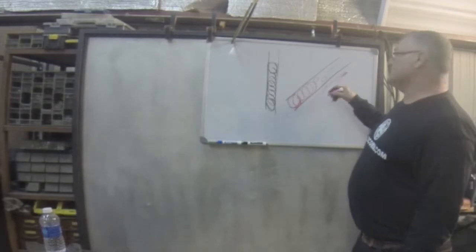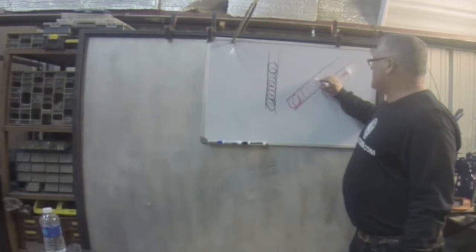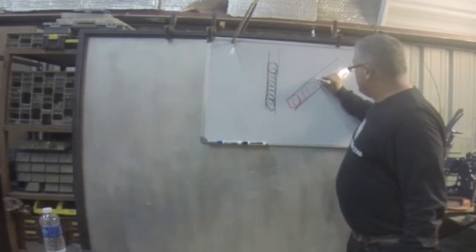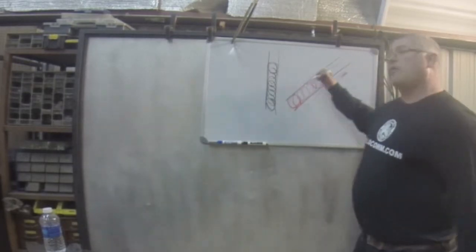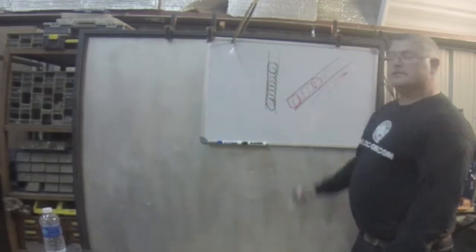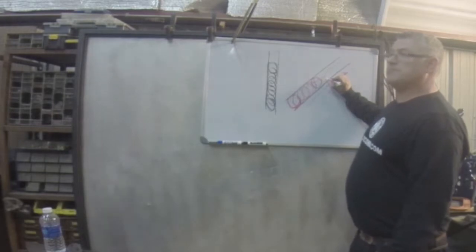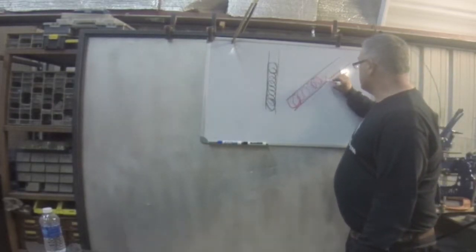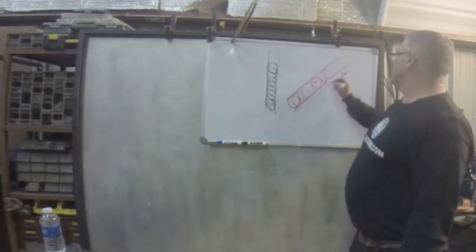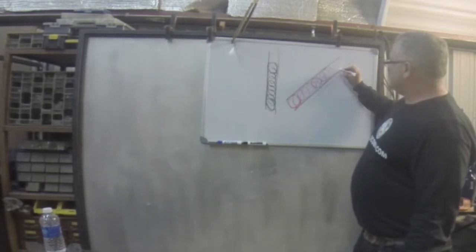But in most situations, time is of the essence. When you're cutting along and you hit a pothole or a little groove or some place that needs a little more fill, the simple rule is just hold your puddle there until it fills out to the sides. When you encounter a little bump with some extra material there, you're going to go a little faster, move ahead faster, and still all your concentration is on those outside two points.